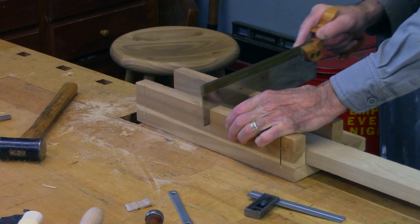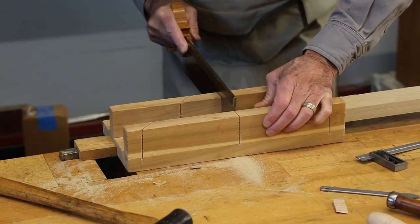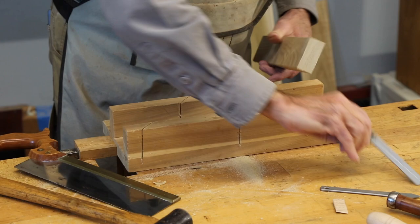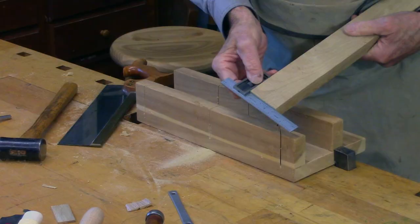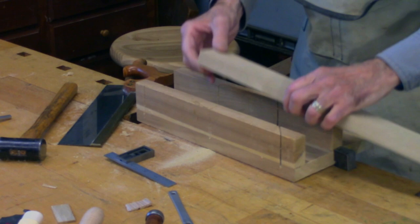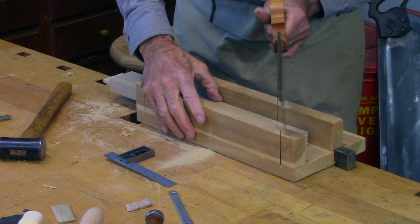and again, this is where the crosscut saw is a little better. There we go. And you see this, cut it both square this way and square this way. You can also cut miter joints with this by simply putting this in there like that. And then you would put the saw down like that and cut a perfect 45.